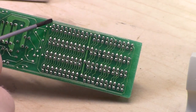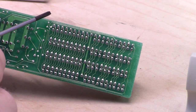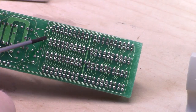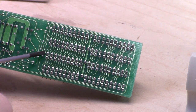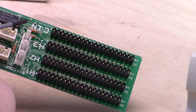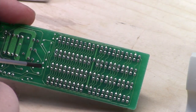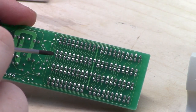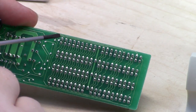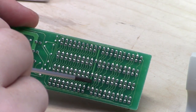So let's do a little tracing here. If you look at this pin right here, this is the first pin on one of the IDE connectors. Follow the trace — it goes from here, around here, to there. So this pin and that pin are connected. Now follow it again, and it goes there. And again, and it goes there. There are no other connections — there could be one on the other side, but I see no vias and I don't see any lines coming out from underneath the connectors. So that tells us that these lines are completely isolated from the rest of the board, only connected to one another. That supports my theory that all the drives are just connected in parallel to the same cable, sharing data lines. That guy there is probably a ground — it's punched into a ground plane on the other side.